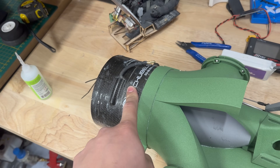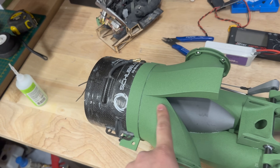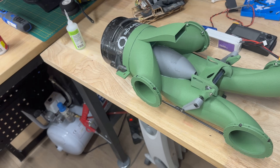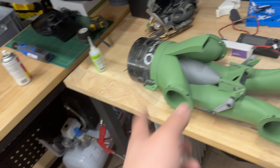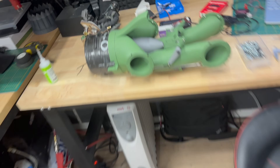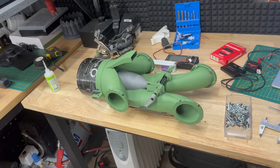This is a 10-kilo push Schübeler running on 12S - according to the data sheet it will pull around 135 amps at this voltage. It's about two kilos less than the bigger Schübeler - this one does 12 kilos while this one does 10 kilos, but it draws less amperage. Let's see if the front EDF and tail EDF can compensate. In total we should have around 13 kilos of thrust, though I'm losing a bit from the bleed air channel, so I'm genuinely unsure of the outcome.